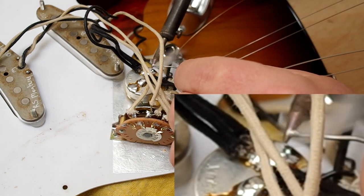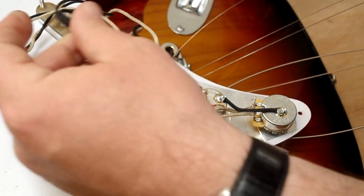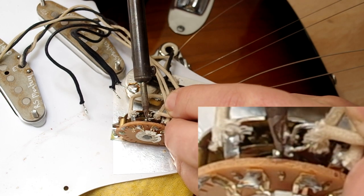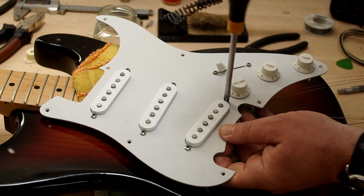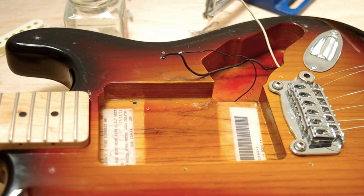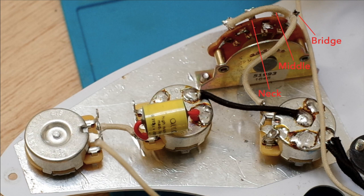What I'm going to do is heat up the soldering tip and look at those black wires going to the top of the volume pot from the pickups. Just a little bit of solder on the tip — that will make it hot enough to melt the solder joint and take those wires off. If you try to do it without tinning and putting a little bit of solder on the tip first, you'll find it difficult. Now the hot wires from the pickups — the white wires — I'm going to trace those to the selector switch and just heat up the joint there briefly and they'll come out nicely. You've got a choice: you can either do the rest of the pickup installation in-situ with the pickguard still connected to the body, or we can desolder those and work on it as a loaded pickguard instead. The two black ones are the ground ones, and there's a hot one from the jack — so we're going to desolder those.